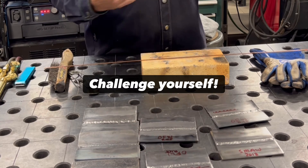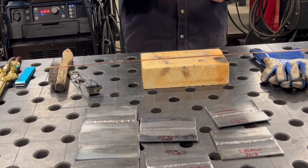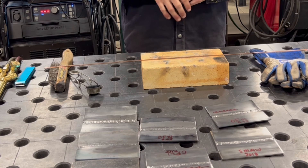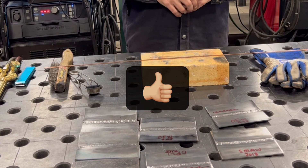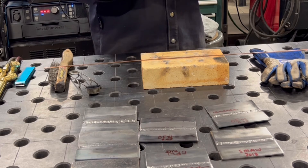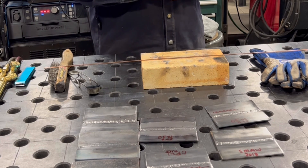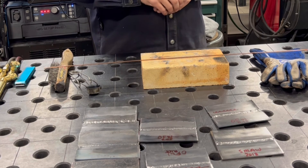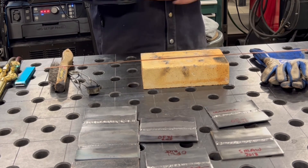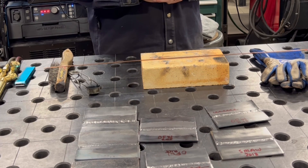Hopefully you try it — flat position, autogenous and with filler, some braze welding, and out of position: 2G, 2F, 3F, go vertical, try overhead. It'll give you an appreciation for welders who did this a long time ago. It's still a great process and fun to work with. Thanks for watching — if you like the videos, leave a comment. I do have a family and making these videos takes a while, but I appreciate you watching and hope I can help you learn and improve at welding.